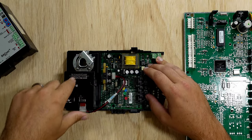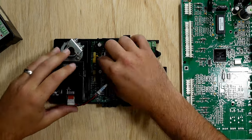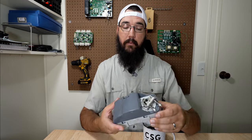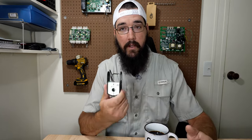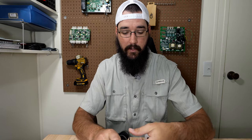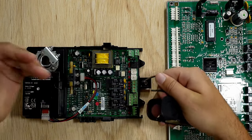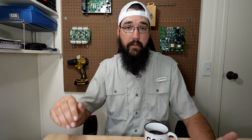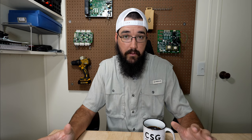Some really common output devices — you see one here: this actuator for damper control is just an output device. There's just a set of terminal wires running between the control board and the actuator. Another example you're probably familiar with is a Honeywell actuator. We should also know about a solenoid coil — it's just an output. It's going to wire in, land on the terminals, close across them, and give power to the coil to activate a liquid line solenoid. Other input examples include a flow switch or a VFD speed feedback. Output examples include your VFD speed reference for fan or pump control, compressor contactor starts, and relays.